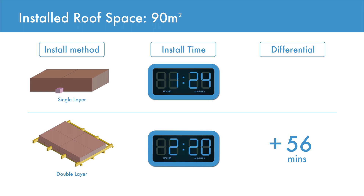But with the single, I can just push it right the way through, it fills either side, covers everything. Both methods achieved H1 compliance. However, as expected, the single layer was faster and was preferred by the installer. Both systems can use either the perimeter bat or the barrier to achieve compliance at the eaves.